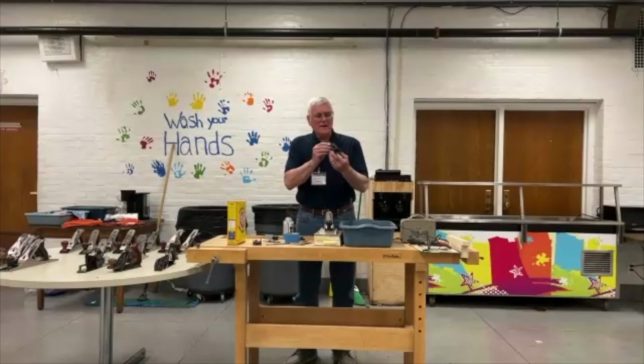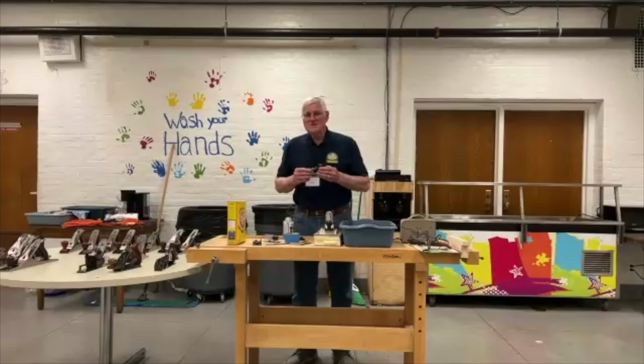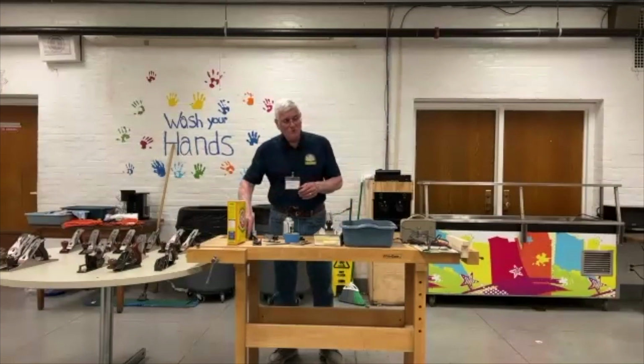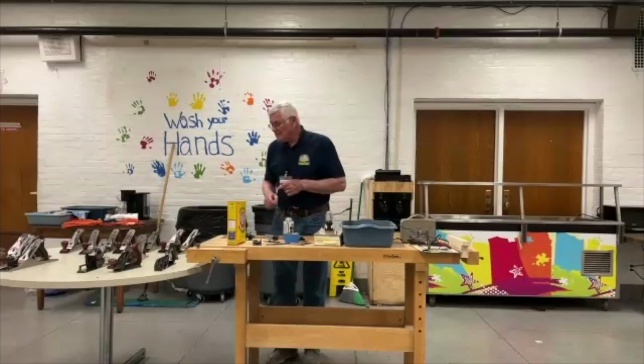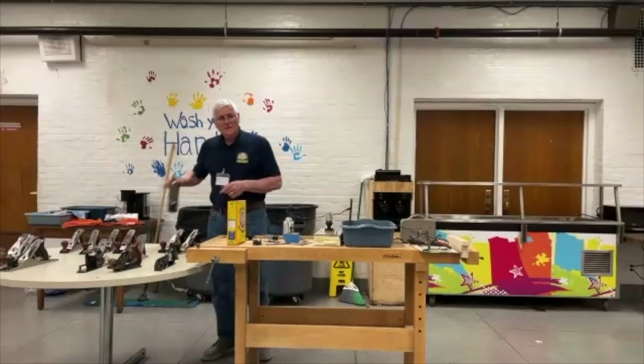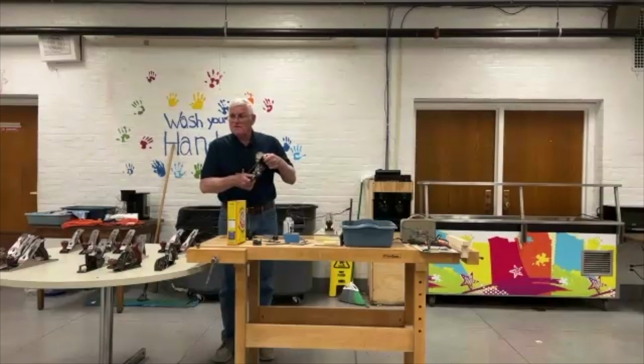Most of them are when they come out of the factory. I've not really had too much of a problem. But the older ones, if somebody dropped it, now you have an issue. Sometimes it's out of line because it was dropped, not that it was made that way. It just happens when people drop tools. And if you drop one of these, they're heavy. There's going to be an impact. You're going to have a dent in the floor and you might have a chip on your blade, or you bust it. And that's how a lot of the handles get broke. It falls this way, and you find these with the piece missing right there. And you guarantee that was dropped. So if you're buying that particular tool, you better look at it really carefully because there's been traumatic force on it.